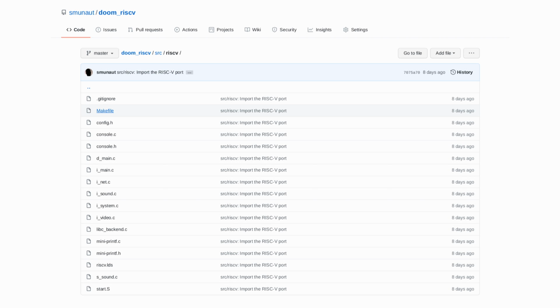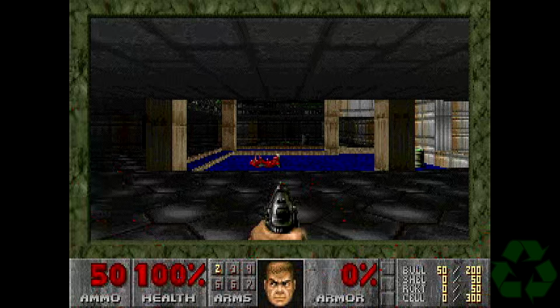This was really just a few quick tweaks. I'm sure there are quite a few ways to speed it up just on the software side. The original DOS version was using assembly-optimized drawing routines. Here is just a generic C version. I've also noticed that different builds sometimes show more performance difference than one might expect, so I suspect that cache line alignment of some piece of data or some piece of code plays a big role. Lots of things to look into if you're interested. Okay, I think that pretty much covers it.